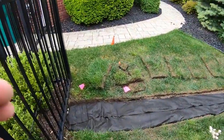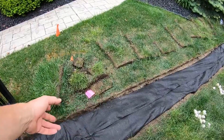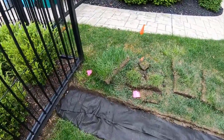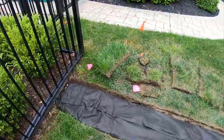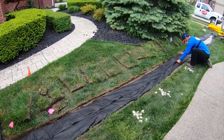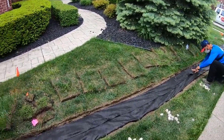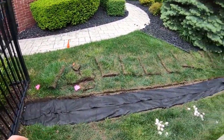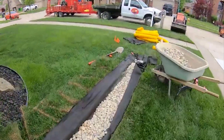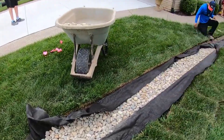Always trim your fabric to fit — you don't want this flap to go all the way to one side of the trench and the other to the other side. We have our fabric punched twice, not once but twice, with enlarged holes put in so grassroots can grow through it. When they start out they're very small like a thread, then they'll swell up inside the fabric. Water will travel down the grassroots through gravity and capillary action and dry this entire area, going down into the stone, moving through the stone over to the discharge — in this case a low-pressure pop-up.